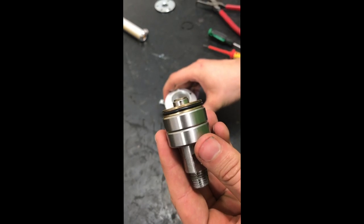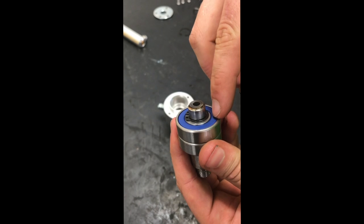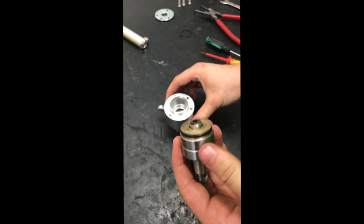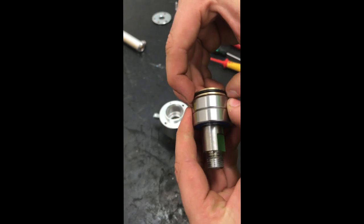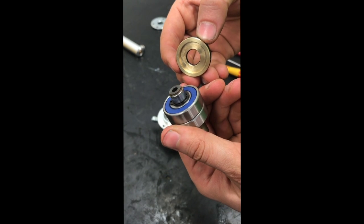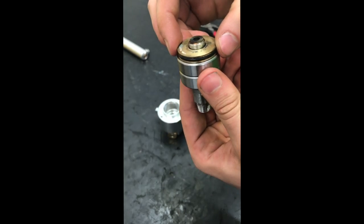You've got a brass washer with an o-ring on either side of it. This has two purposes: first, to stop water going down through the bearings if the water seal fails, and second, to stop the grease coming in from this point going up and packing the top of the casing. So these o-rings have basically two purposes. You've also got a recess here for the grease to sit in as you pack the grease into the unit, which comes in through the second hole.